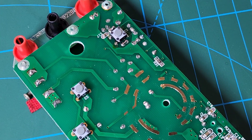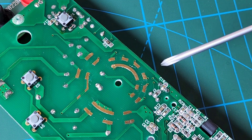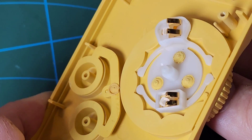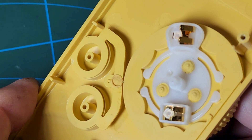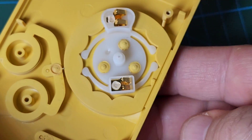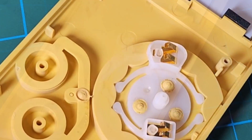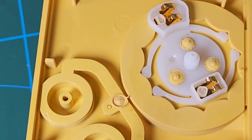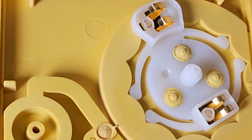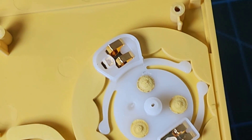There's a little bit of oxidation here, so I'm going to give this a wee bit of a cleaning and some fresh dielectric on those tracks as well. On the other side of the PCB is the rotary selector switch — just two pads in amazing shape, with a plastic inlay acting as a replacement for those balls and springs. We also have our elastomer over here at the top. The buttons use a thin plastic inlay rather than soft membrane or soft-touch buttons, working by friction — and it seems to work. Very, very cool.